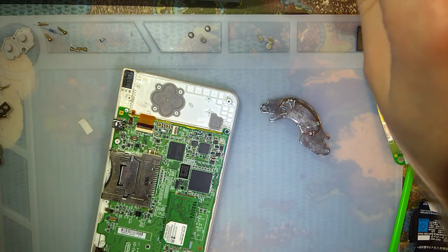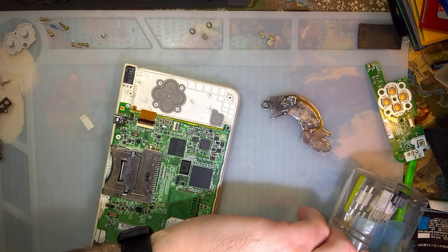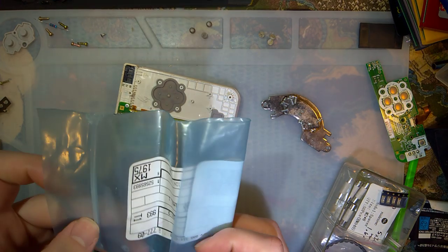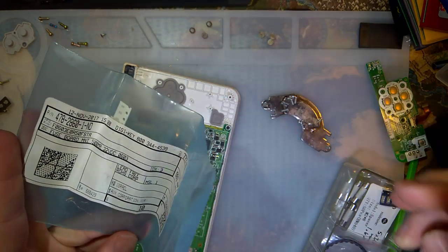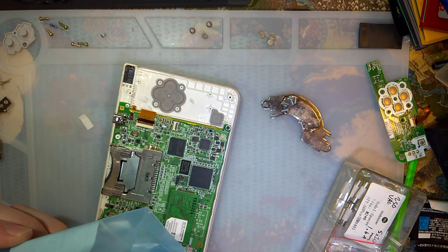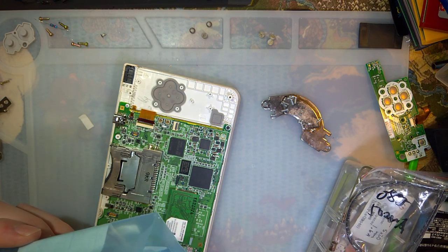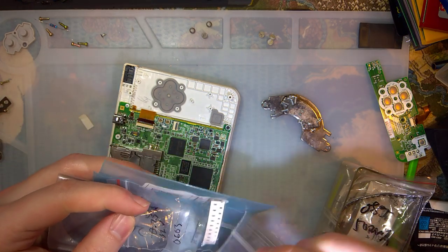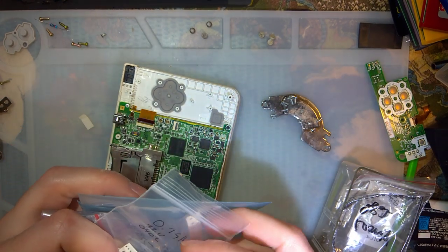I just remembered I set up my parts thingy here, so I have fuses right here — didn't actually have to go far. I think it's this fuse. No, these are only 500 milliamp fuses; this one is probably a lot closer to triple that. That's a quarter amp... it's three-quarter amp. Well, that's the closest we're going to get.